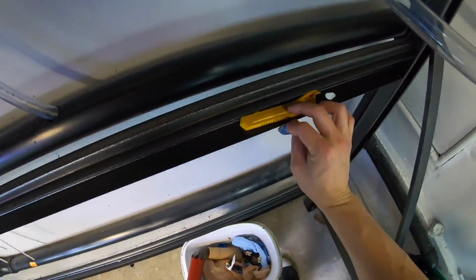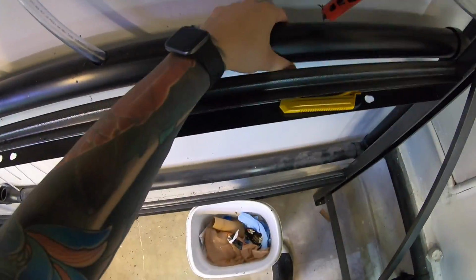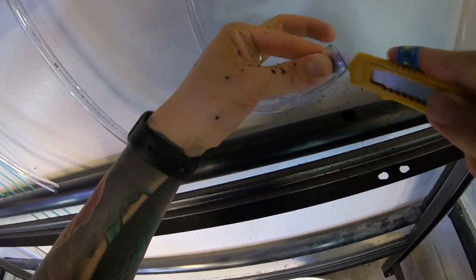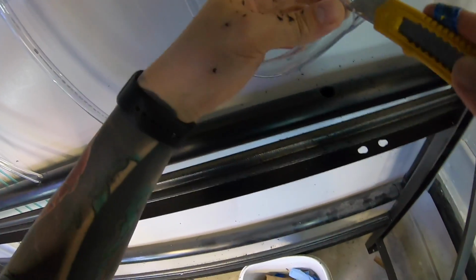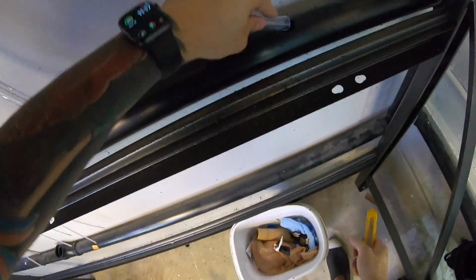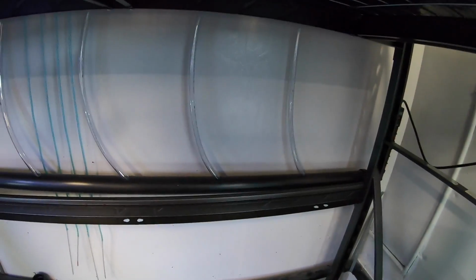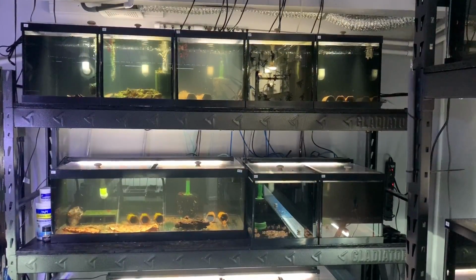I think it's 3/4 inch holes, and so I'm just plumbing directly into that, and I'm leaving at least 2 inches of that Python tubing, that Python drain line, in the ABS. So you basically have to lift the entire tank out or really pull that tubing out with some gusto to actually get that to come out of the drain line. So it's not like it's just barely hanging in there. Again, we're talking about water in my house. Granted, this is a room I built in my garage that naturally drains away from the house, but I don't want to chance it. And now what you're seeing is I'm taking some time showing you, yep, there's the drain lines. And then we kind of pan back, give you a chance to take a look at the other drain lines.